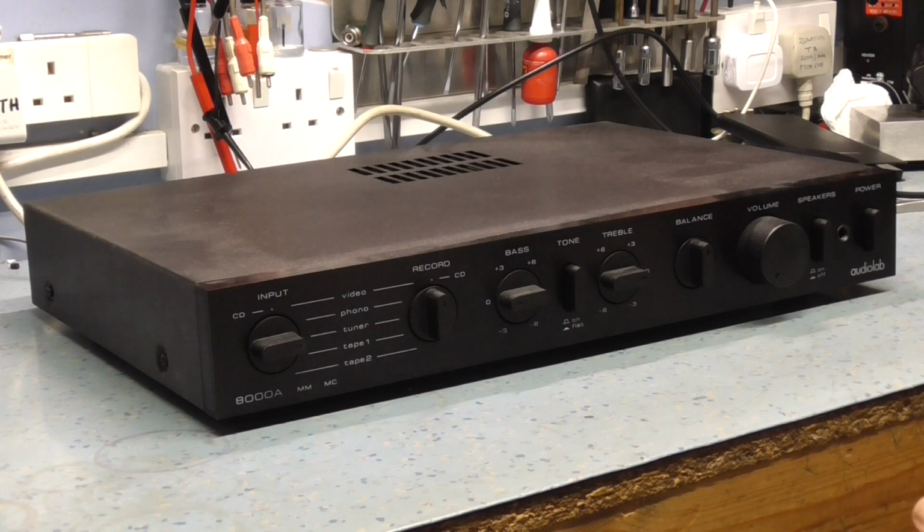Now immediately you can't check it, obviously, because if you connect a DC voltmeter to the output of the amplifier, because the relay hasn't released, you won't see any DC voltage anyway. So you need to take the cover off and look downstream of the amplifier's relay and measure the DC voltage at the output of the amplifier. The easiest point to measure usually is on the emitter followers. You've got some emitter follower resistors, usually very low ohm ceramic resistors, and you measure the center point there relative to the 0 volt connection on the back of the amplifier, or the negative side of the speaker connection, and measure your DC voltage there, because you will see the true output of the amplifier, what it's doing when you're powering it up.